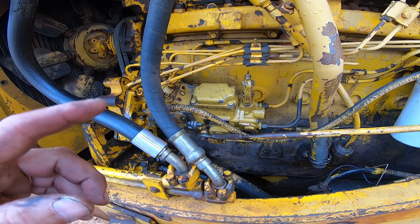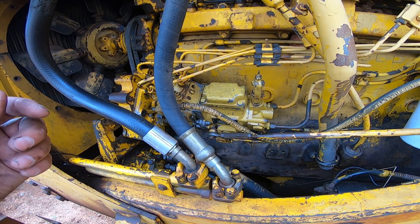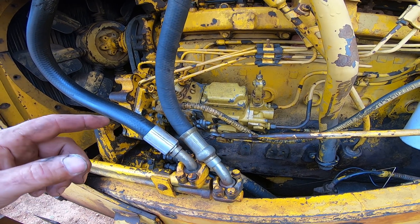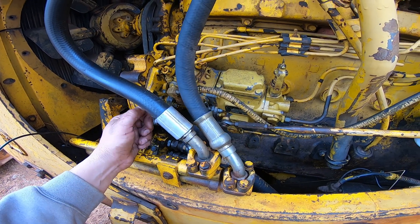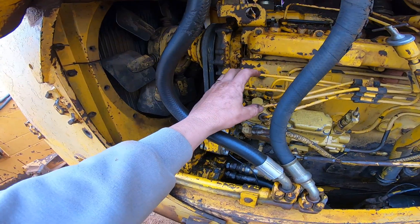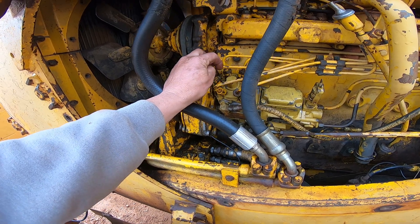One of the big differences is this pump has a smaller gear, so it actually turns at a one-to-one ratio with the engine. When I first saw that I was like, that doesn't make any sense — but reading about the pump, there are actually three lobes on the camshaft that run the plunger up and down to pump the fuel. The distributor head — I call it that, I don't know what the book calls it — actually runs at half speed.